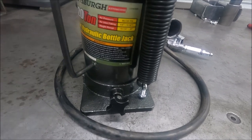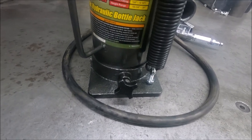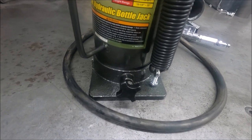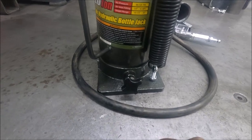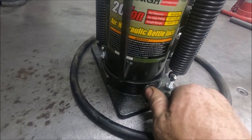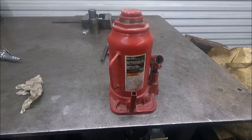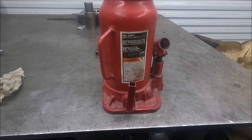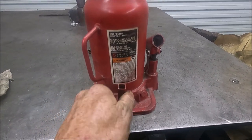What I had to do was take a much longer roll pin, grind it at an angle on the end to get it started, and then it pushes through there real hard. Then I cut it off the right length. One thing Swag Off-Road should have done is made this handle bigger — it's a little bit small. Here's the old jack. I want a little piece of square tube to do it, and it's much easier to use being that size.